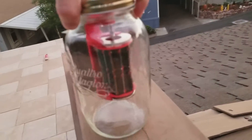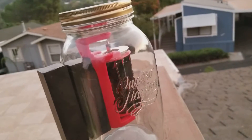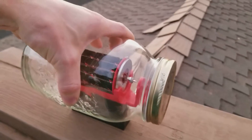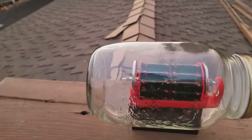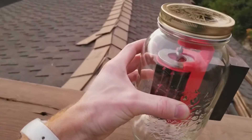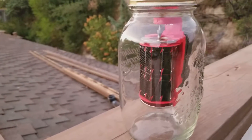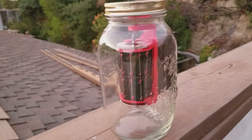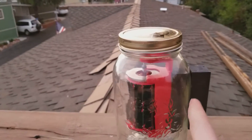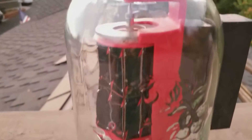This little Pulse Motor that I built for the contest has its problems, and I'll explain those in another video. You can see how it's got a magnetic imbalance. If it was an imbalance of the wheel, it would act differently vertical, but it doesn't. So the magnets themselves actually have a problem. It has a lot to do with these guys — when they're not there it's a little better, but even then, any angle gets all screwy.